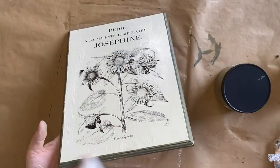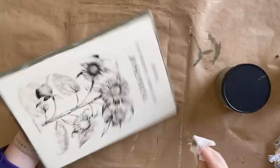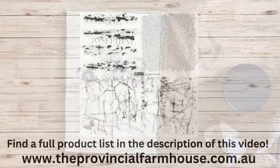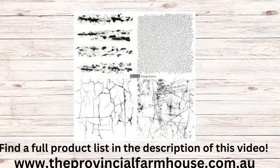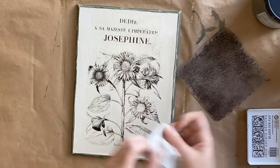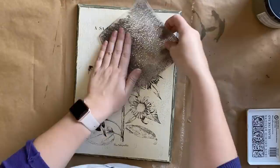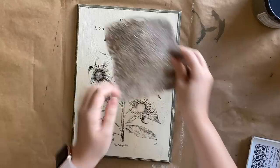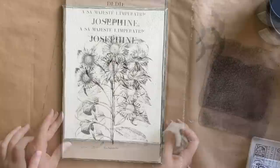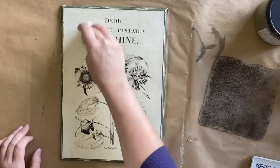When my paint has started to dry I'm going to do some wet distressing with a baby wipe. I'm going to pull some of that green back so that you can see a little bit more of the buttercream underneath. I just want this to have a bit more of a cottagey, weathered feel. To finish this off I'm going to be using the Crackle Style Stamp from the Vintage Textures Stamp with IOD black ink. I've inked up part of my stamp and I'm just gently laying it down here and there — not pressing the whole thing. Then I'm going to come in with a baby wipe and actually wipe back some of my ink. The gloss clear coat has sealed my paint so I've got a little bit of work time to gently remove some of the ink. It's going to give it a more faded vintage feel.